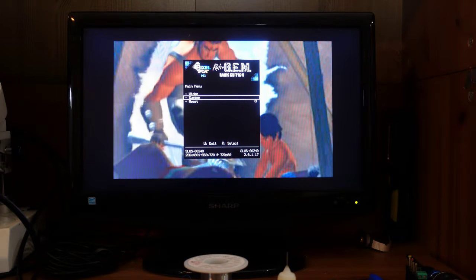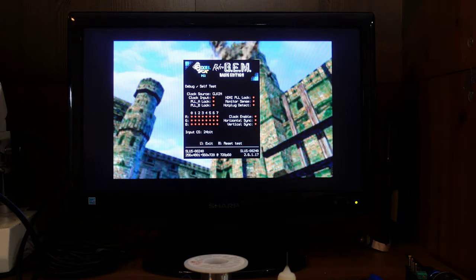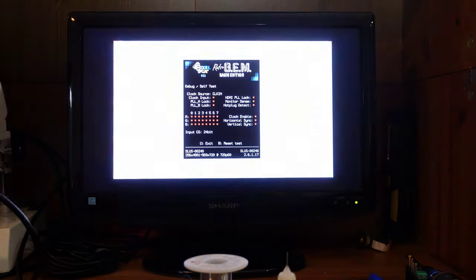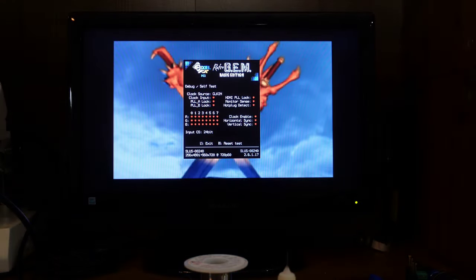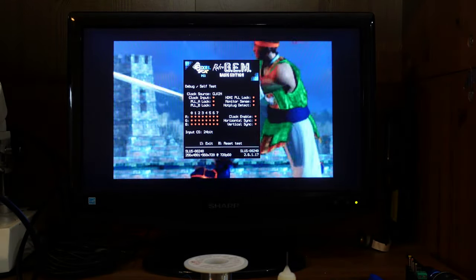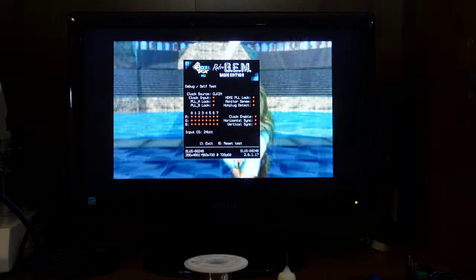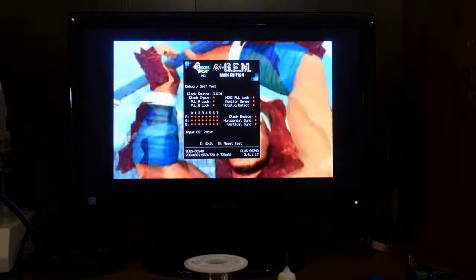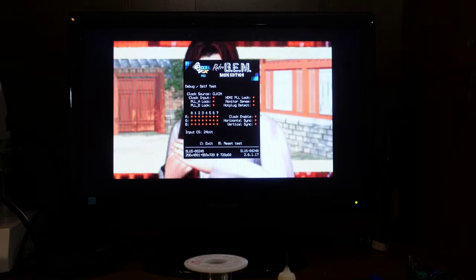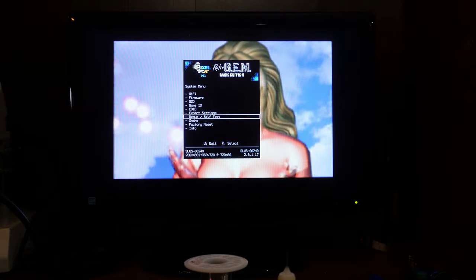self-test. To do that, you've got to go to the system here, and then you go down to self-test. And while you have the FMV video running, you can see that there are hearts on all of the various lines. So this is great. This tells me that all of the connections on the GPU Flex are correct. If they weren't, you'd actually see an X here, and you could actually take this information and match it to the pinout of the GPU and find out exactly which pins are either not connected or maybe bridged to a neighboring pin, and then you can go back and fix that. But thankfully, in our case, everything is looking perfectly here, so that means our installation is all set.